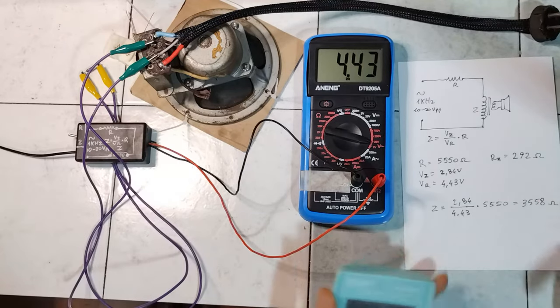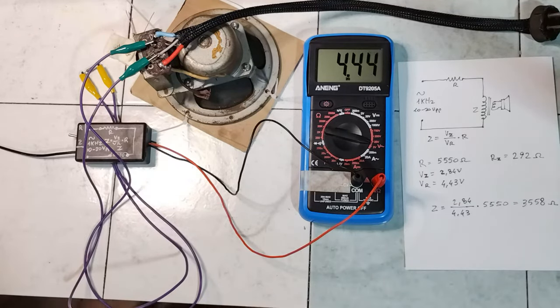The calculation shows an impedance of about 3.5 kilo-ohms, which is the half of what the tube type 42, but also the original tube type 47 would need. However, this is what was used originally and it is kept as it is.